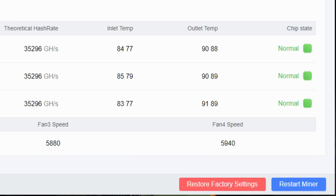So, what does this tell us? This tells us while the unit was quieter, the airflow was restricted significantly based off of that setup. So I'm like, all right, is the air filter box restricting airflow too much? In my mind, and granted, this is my mind, guys, the fans on the ASIC aren't strong enough to pull air through the air filter box.